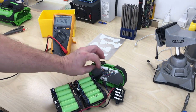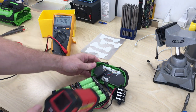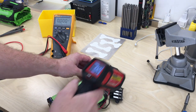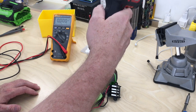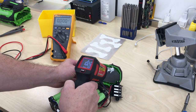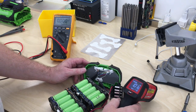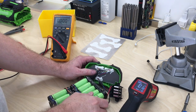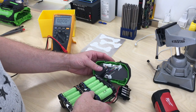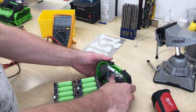I waited a while and came back just to check, because I still feel the warmth in this potted circuit board. I don't have a nice thermal camera, but you can definitely tell from ambient — at some point it's over 20 degrees above ambient, really over 30 in some places. There's definitely something going on making that LED blink, and possibly a transistor or something shorted, which is why it's getting so warm. The LED itself wouldn't draw enough current to make the circuitry that warm.